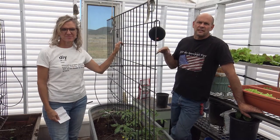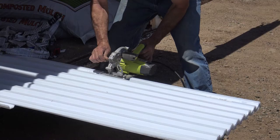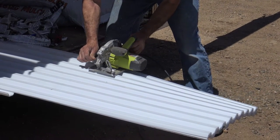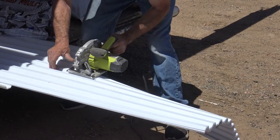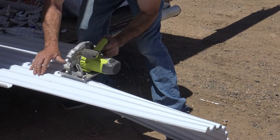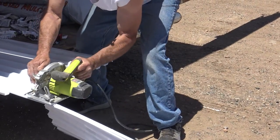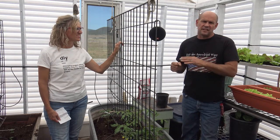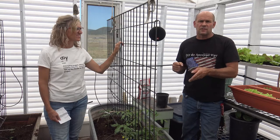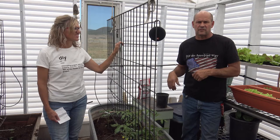Cutting polycarbonate is super simple — it's just plastic — but you need to buy a fine-tooth saw blade for your circular saw, more like a plywood blade. The key is to turn that blade backwards so the teeth are cycling in reverse. That way you're just pushing through and the blade cuts the soft polycarbonate cleanly. If you run it the normal direction it will catch and start chunking pieces off, so the reversed blade makes a big difference for a clean cut.